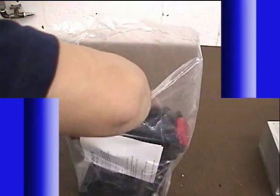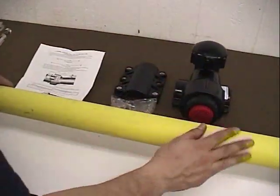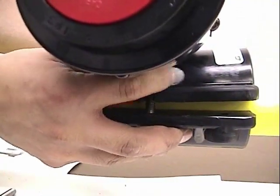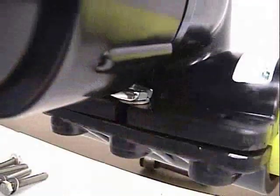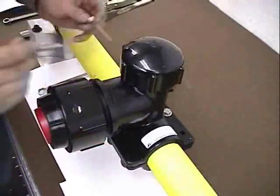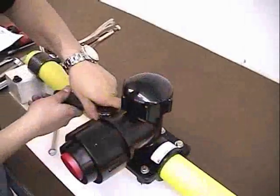The high volume tapping tee, or HVT, comes with the installation instructions inside the bag. The bag contains the printed installation instructions, saddle top with compression outlet, saddle bottom with six mounting holes, and the mounting bolt package containing six mounting bolts. The area where the saddle is to be installed must be clean and free of cuts and scratches. After the mounting surface has been prepared, place the top part of the saddle onto the pipe, then the bottom part, joining them together by hand. With this installation, mount the two center bolts first. Of those two, there is one short bolt which mounts right underneath the outlet. Mate the saddle bottom to the saddle top against the pipe, placing and tightening the two bolts in the center holes first. In a criss-crossing motion, tighten the remaining bolts, making sure the saddle doesn't slip or turn on the pipe.